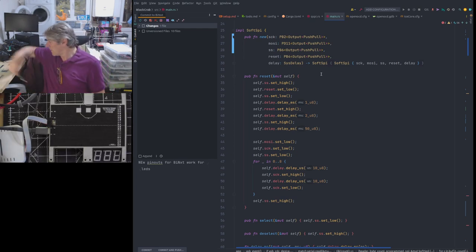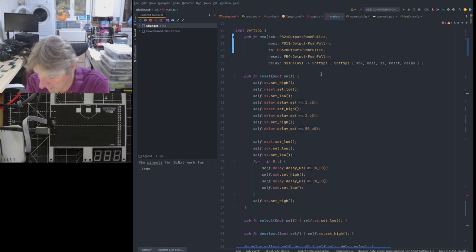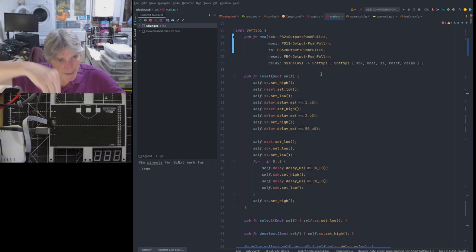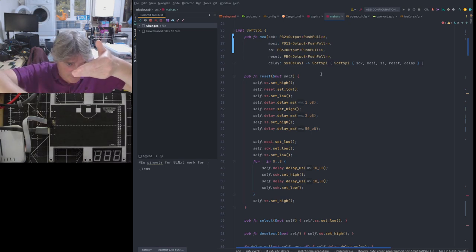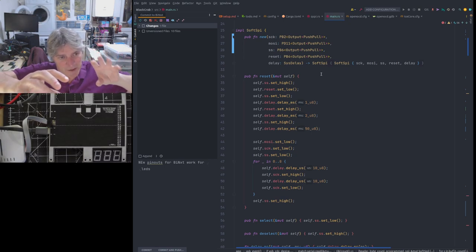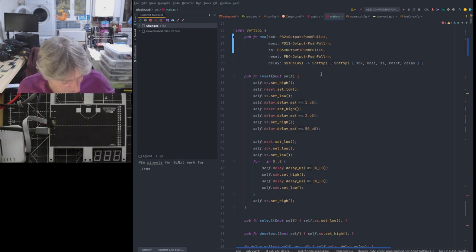The only way I could do it successfully in the end was using, you know, the proverbial heat pencil and heating the entire area. I was a bit worried because the board's upside down. I'm heating the back and trying to pull the connector down, but I'm also trying not to dislodge the USB connectors, which are hanging upside down, or any of the other components in that area, which I was really worried about. But I did manage it.